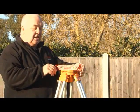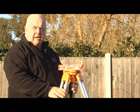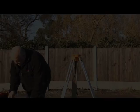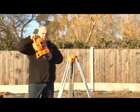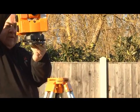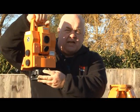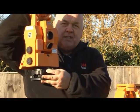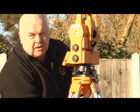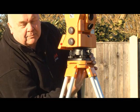What I then need to do is use some sort of spirit level to make sure that the base of this is relatively flat. Here we have one EDM machine. We're looking for the output for the power, because we want to place that facing away from the operator. Place that clearly onto the top, and then by using the screw underneath on the tripod, fasten this down appropriately.